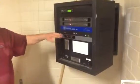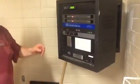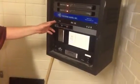One of the things I did was drive away, and halfway back to Fargo I went, I don't think I set compressors on there. I better set limiters on it. So that's one thing I'm going to do today: put some limiters on it, so that if somebody gets completely berserk out there, it'll give some measure of protection to the speakers.